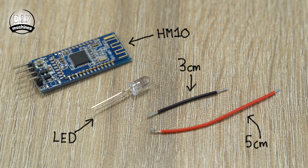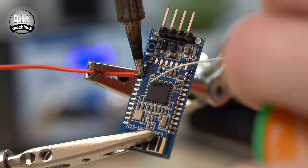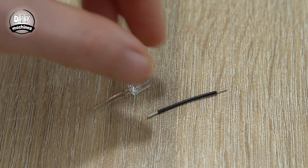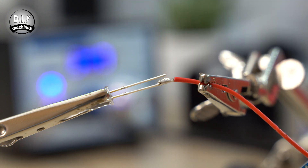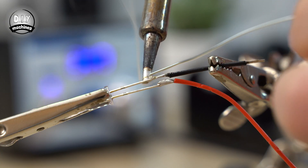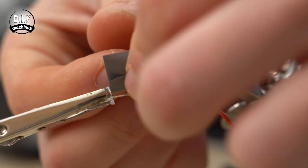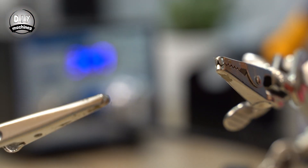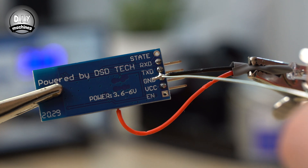Adding the LED to your project is an optional step, but it does make it much easier to tell when your phone and the HM10 have a current active Bluetooth connection. For the LED, prepare two lengths of wire: one 5cm long and the other 3cm. Solder the 5cm long wire to the third pad on the module. The other end of this wire can then be soldered to the positive anode of the LED — that's usually its longer leg. We can then solder the 3cm wire to the negative cathode of the LED. Wrap some insulation tape around the legs to prevent them shorting the circuit if they touch each other. The other end of the ground wire is then soldered to the reverse side of the ground pin on the Bluetooth module.